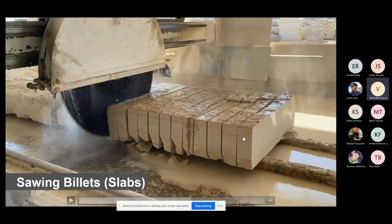And as you can see here, these are 4 and 6-inch slabs. You can see your 6 inches here. This is eventually going to be the face of your veneer. And here's your color seam that we mentioned. You got a white seam. You can see the dry lines or the bed seams that we showed you in the drawing earlier. You can see the lines here. Those are naturally occurring in the rock. And we want to cut this block in this direction.